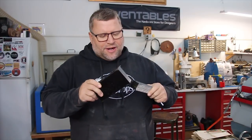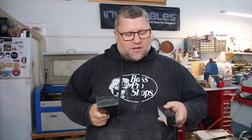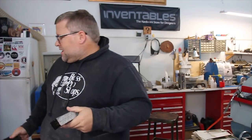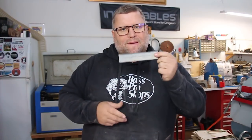I've got my micarta block here and I cut a square out - same height as the thickness so it has an even block. I cut this on the bandsaw and the table saw just to compare, and both cut it fine, but it was a slow cut. I really had to take my time because this stuff is really, really hard. With all those layers of Liquid Diamonds resin, it makes a really dense, hard product. It's a little over an inch, so rather than make a pen out of this, I think I'm going to make a bottle opener handle. I've got a bottle opener here and I'm going to go ahead and drill and tap it, then put it on the lathe and spin it.